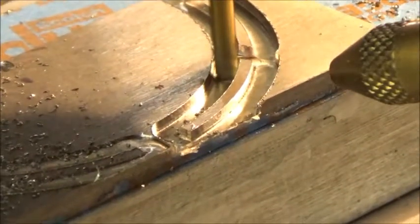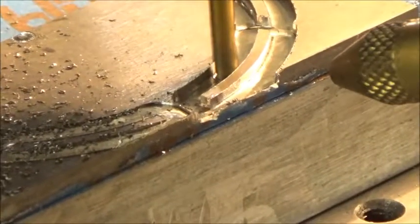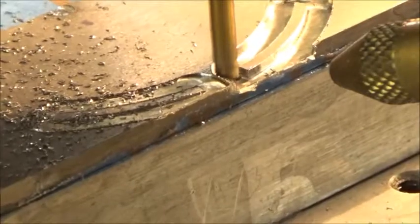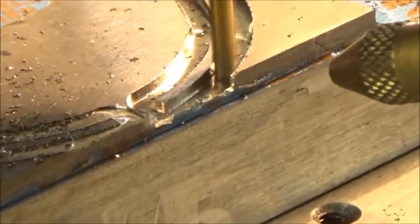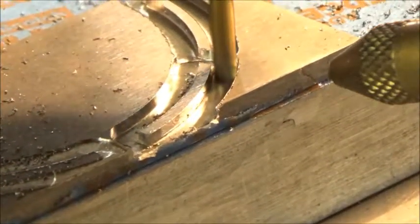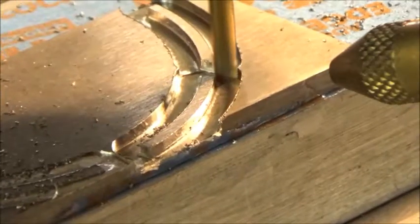So we'll see what happens. I won't be able to tell until I get to the other side of the cut. If you notice the last time around, on the other side, as soon as I went over there on the back portion, it wouldn't even cut. It wasn't even hitting the material. The end mill had pushed up into the collet enough that we were losing between five and ten thousandths of an inch on the cut.